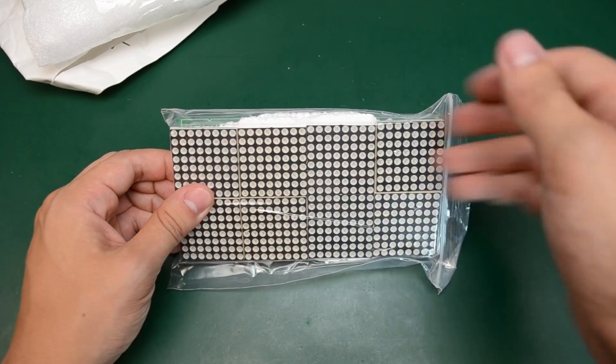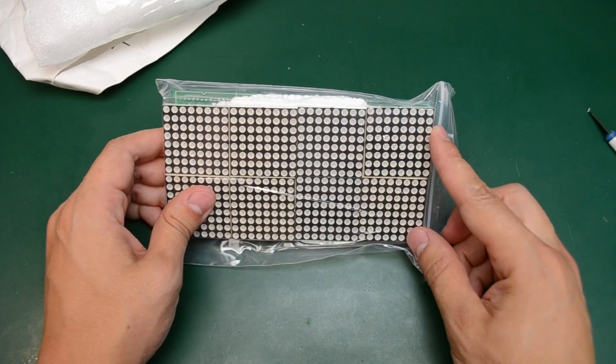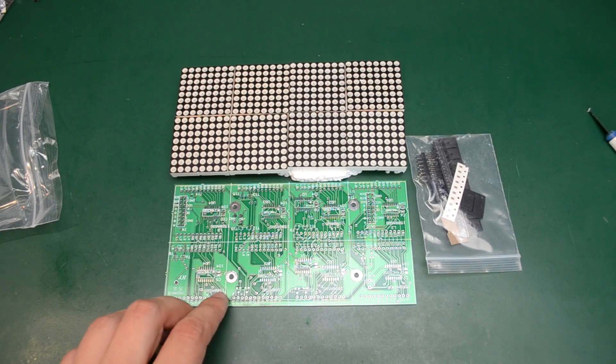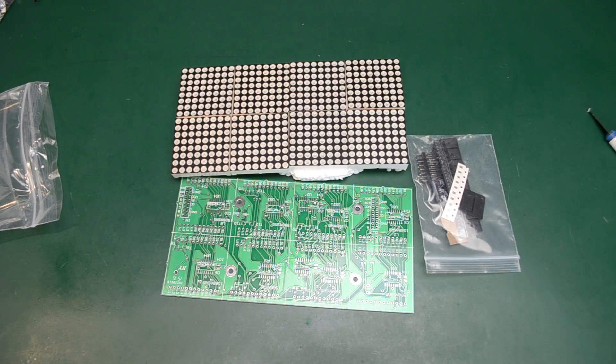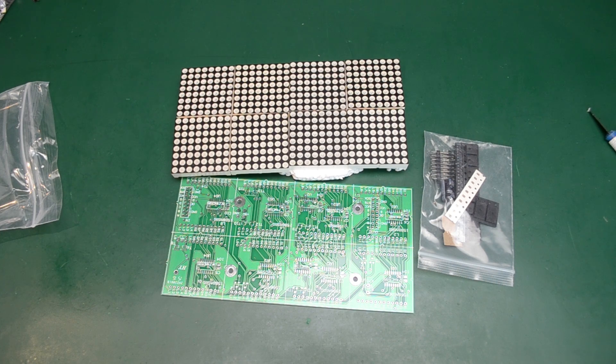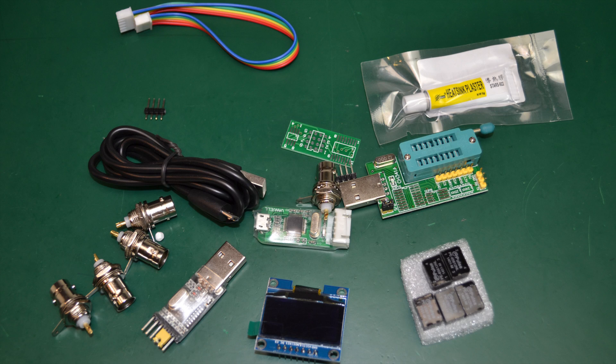Our last item today — you can immediately guess what this is judging by the LED matrix. To be more precise, this is a 16 by 32 LED matrix. This particular model has a dual LED arrangement so you can get both red and green for each pixel. On the PCB we have shift register ICs as well as some serial to parallel decoders, so you'll have to provide your own code to drive this LED matrix, and of course do some SMD and through-hole assembly to get it together. I'm sure there is an Arduino library for driving this kind of module so it should be easy to get up and running. This also comes as a kit requiring soldering, so more details in an upcoming assembly video. As always, thank you for watching this 'in the mail' episode — feel free to leave a comment or hit the like button if you enjoyed it. Links for all the products are in the description below.